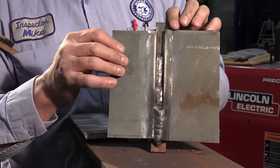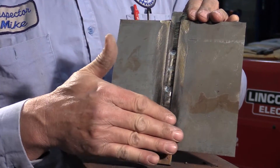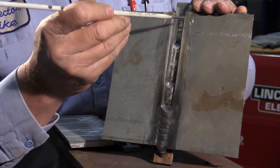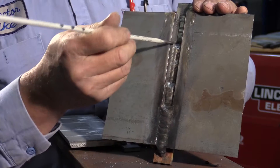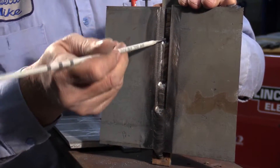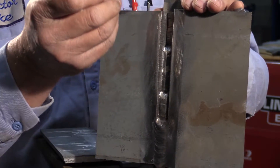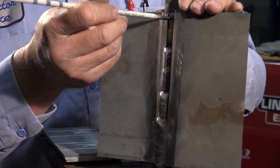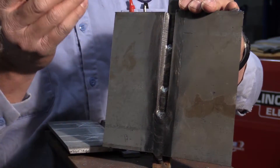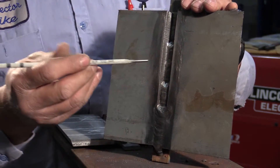On 3/8 plate it's normally going to take three passes to fill it out. I have to be above surface — I cannot be low. On the root pass, all I'm focusing on is burning these bevel points into that backing bar. If I'm doing it right, as I come up there should be a bit of a divot — that tells me I'm penetrating the backing bar. The idea on the root pass is not to weld the two plates together; it's to burn into the backing bar. Then I clean that off — grinder, brush, everything — make sure there's no slag. If I have any convexity in the toes, I'll knock that down.